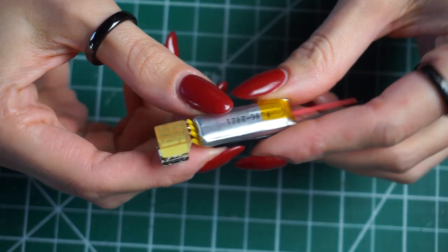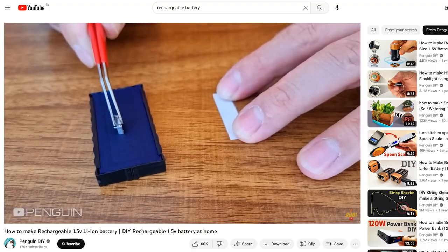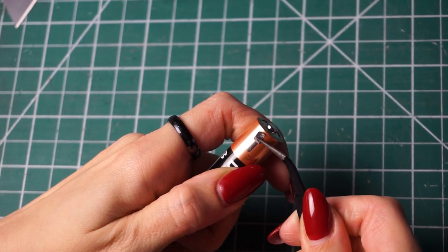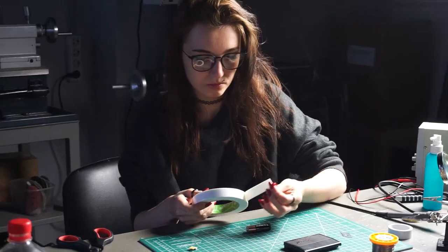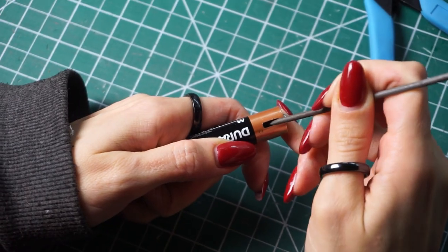This is the stuffing assembled. Almost everything is ready to assemble. It remains to put the finishing touches: the holes in the case for an LED charging indicator, and the holes for the charging plugs. In the original video, the author used scotch tape and a stamp pad to transfer the connector outline — I'll try to do the same. Luckily, I have the tape and a stamp pad. I cut with a blade along the contour and remove the film so that the edge of the film at the hole isn't ragged. I will mill the holes — to hell with handwork! I fix the body in a vice on formed double-sided tape for reliable fixation and protection of the case from scratches. Gently mill. Perfect! Especially after finishing it with a rasp.